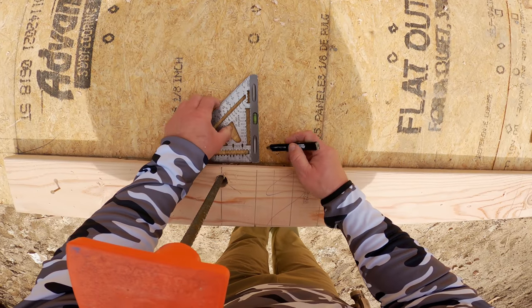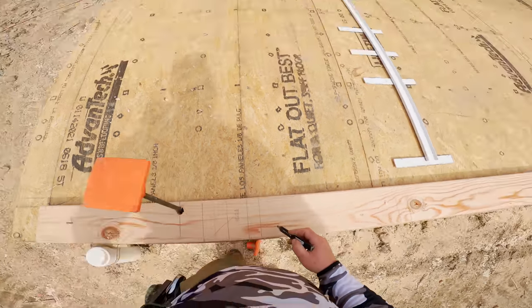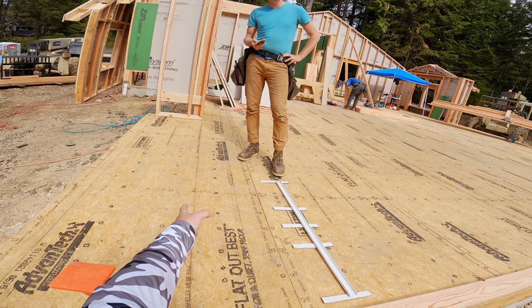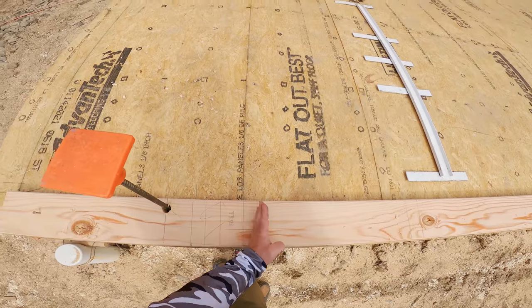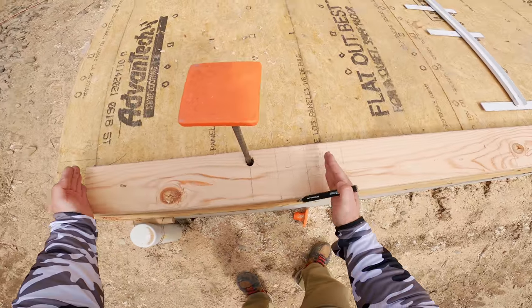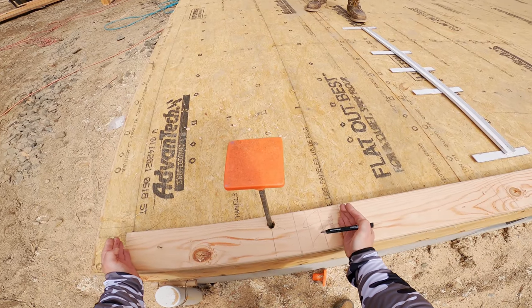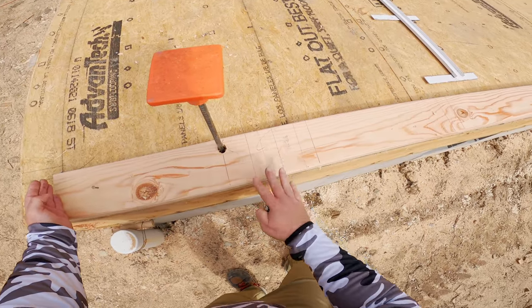Sometimes, I know we've had to cut these out before, it's kind of a hassle. But this time we have an LVL shooting across instead of a beam, because Terry engineered it. So if that caps this end stud, to sit on the flat wall and nail in, we would be flat from here to here. Right. Which I think I could cut plates now, but might just cut them after the fact. Whatever we want to do. There's really no studs. It would be a 6x6.